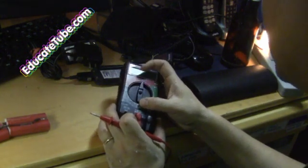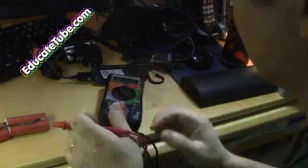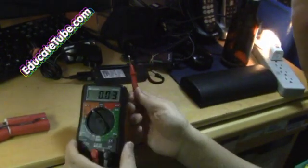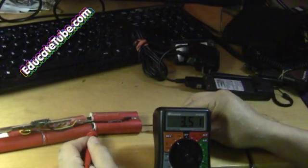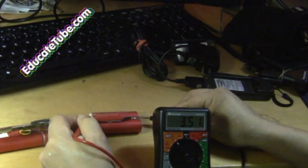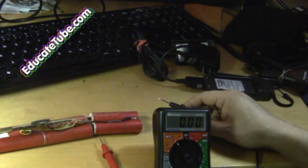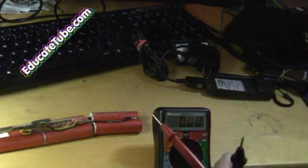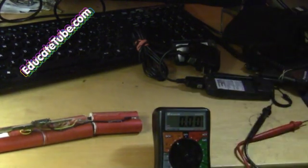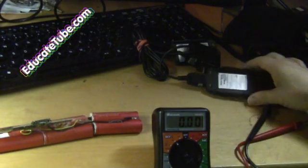Especially those powerful LED lights, you can use them. I'm going to measure the voltage. You can see here it's 3.51 — that's how much voltage I found in each of these rechargeable batteries. It can still be recharged. Now, you don't want to just recharge it with any type of recharger — it cannot be nickel-cadmium. It has to be a lithium type.